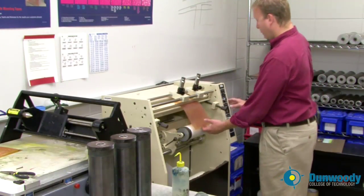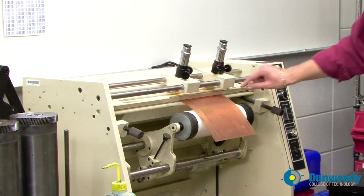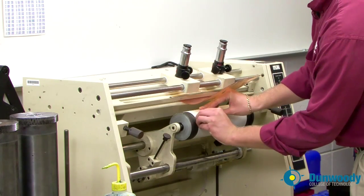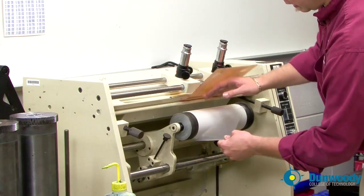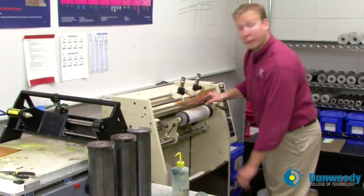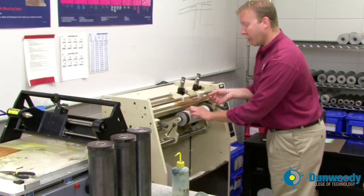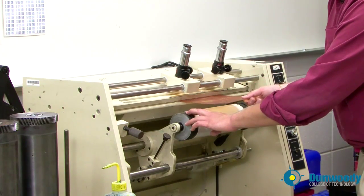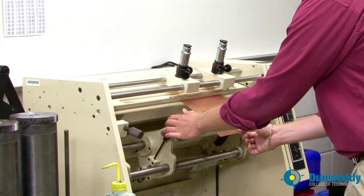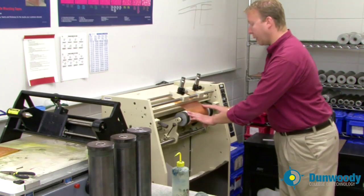Once they are lined up, bring the cylinder up by pressing the print cylinder up button. Bring it up until it's about an inch away from the plate clamp. Lift the plate and remove the sticky back liner. As you are removing the liner, inspect the sticky back for air bubbles — if there are any, remove them with a razor blade. Now rotate the cylinder so the scribe line or the sticky back butt goes into a non-image area. Grab the plate by the center, tug it, and apply it to the cylinder. It is important that you pull it straight down — not left or right — so it gets onto the plate cylinder correctly.